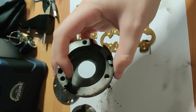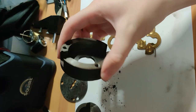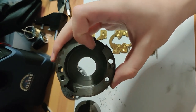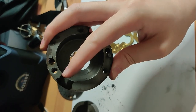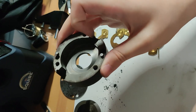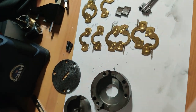The first is that it goes in here, the wafers go here and here, and when they all come inside, it opens. There's the back. This side is chamfered, so this is when you're picking anti-clockwise, and that is for relocking it. I'll demonstrate what that does in a bit. This side, you have tapering on the inside of here. It's hard to see. You can maybe see it from this angle. I'll zoom in more later when I'm reassembling it. You have tapering on this side too, and that is for pick resistance. That makes it extremely tapered.